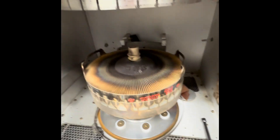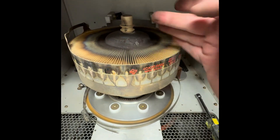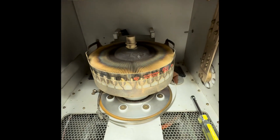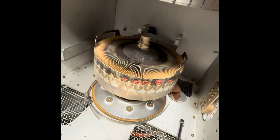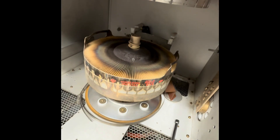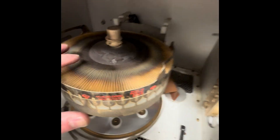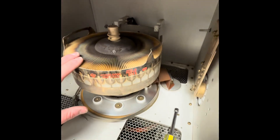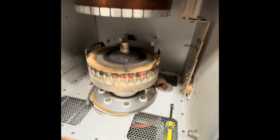You can see the tube — this is normal discoloration. This is a silver-plated tube, and heat and air flow creates an oxide, so this is just silver oxide. It looks burnt but it's not. It's gotten warm, though. These tubes do get warm — it can dissipate 20,000 watts of heat through these fins.